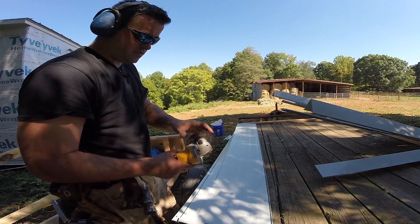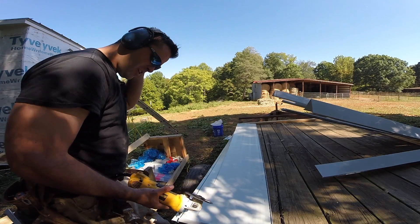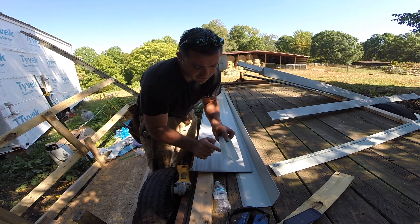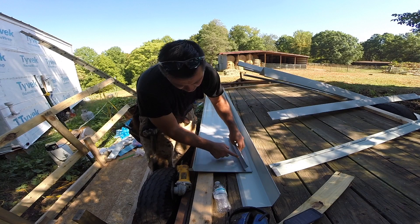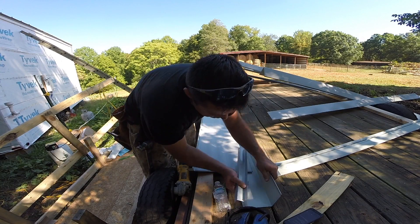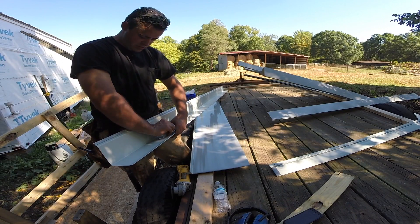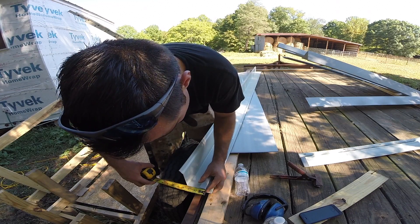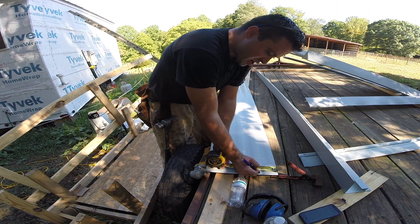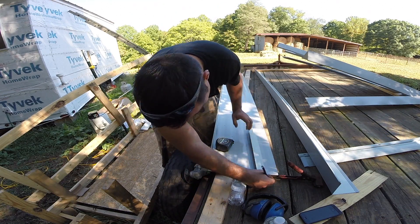This is my third cutting disc I've used on this project so far at $2.50 each — those little costs you don't think of. So just like that, the other side — I need to install this piece. Now this has got two different colors. When you're installing this, you want to make sure that that color side is going to be facing out so it's exposed. I stick this in here and I measure three and a quarter inches. From the outside, if I measure in three and a quarter on the top and bottom and snap a line, that line will represent this inside point right here. So this will get put on just like that.